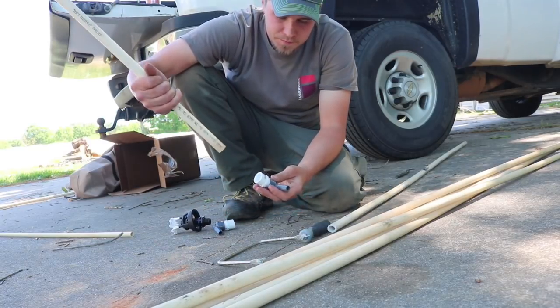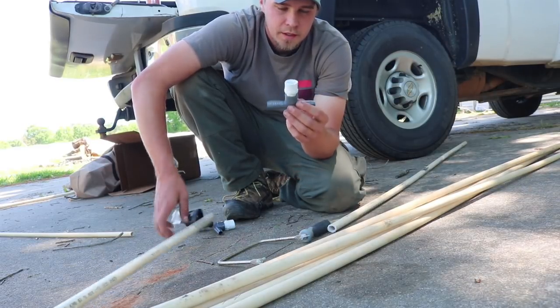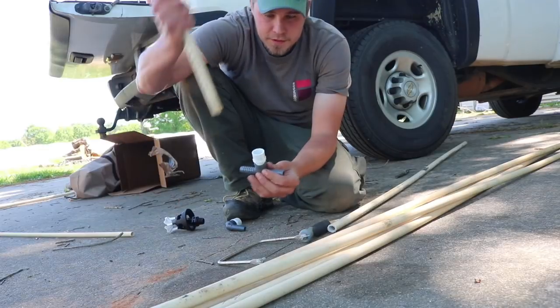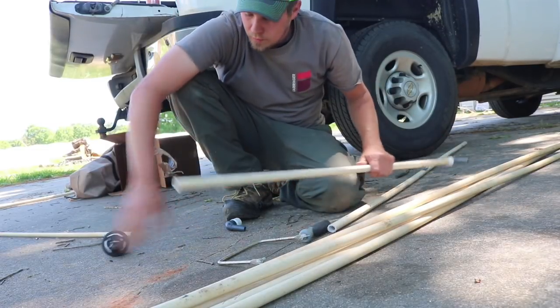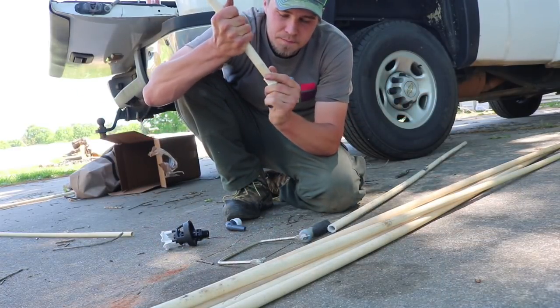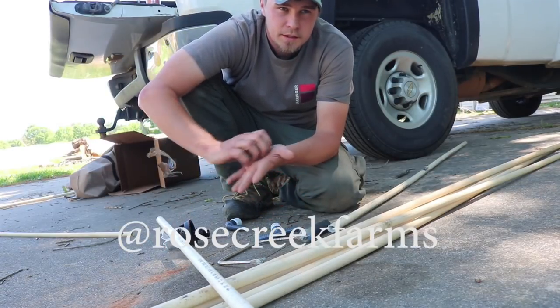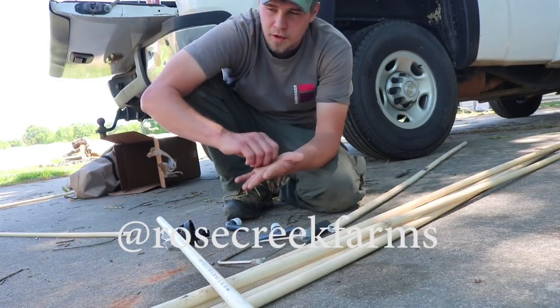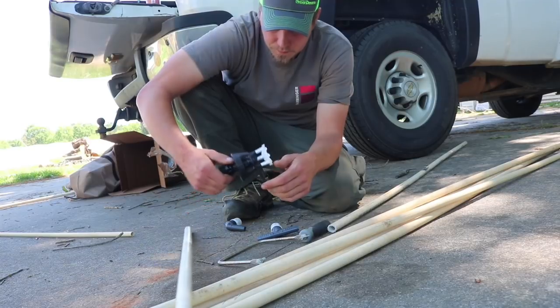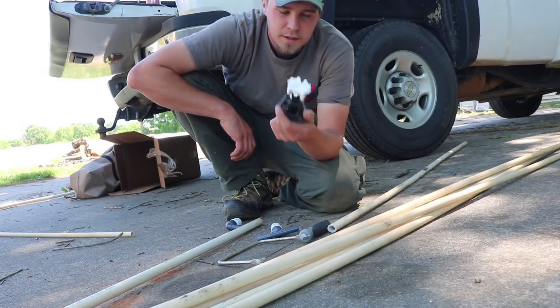The bottom of these wobblers, so we have poly tubing, this black tubing that goes on here, and then this sits in here, and the wobbler goes on top, and we set 4 of these up per 100 foot bed. We got this set up from Ray Tyler at RoseCreek Farms, where we learned all this irrigation stuff. Yeah, these are really effective. And this is 2 gallons a minute. I'll show you all the wobblers working. As you can see, I got some running now.